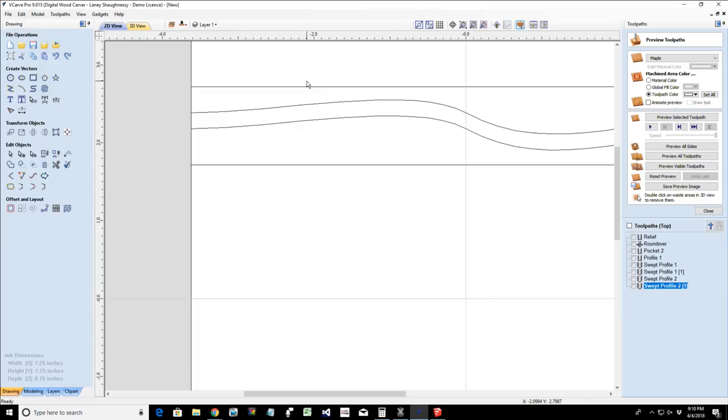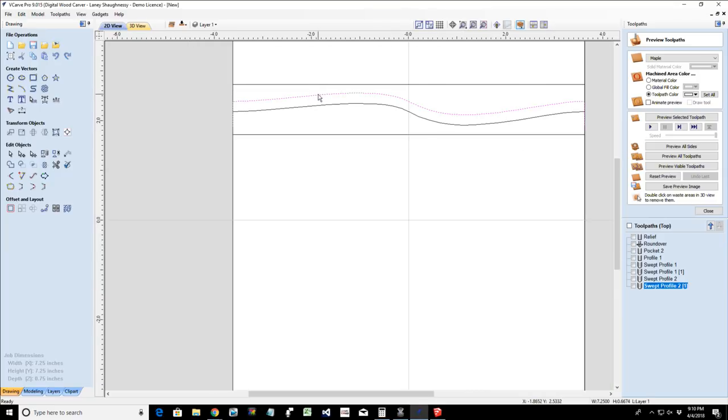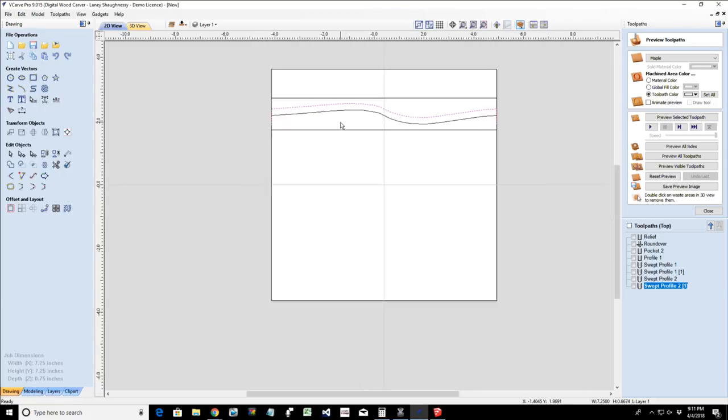We're going to have a block on the CNC that will have a nice little curved band in it, and we're going to have it glued up. We're going to throw it back on the CNC, and then we're going to cut out that ring. So on our ring, we're going to have that nice curved loop all the way around, because we're cutting all the way out, so we're getting that nice band in there.